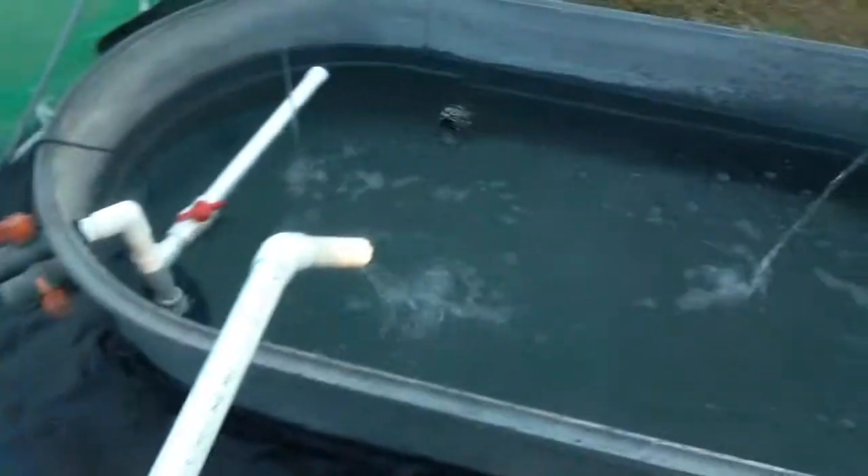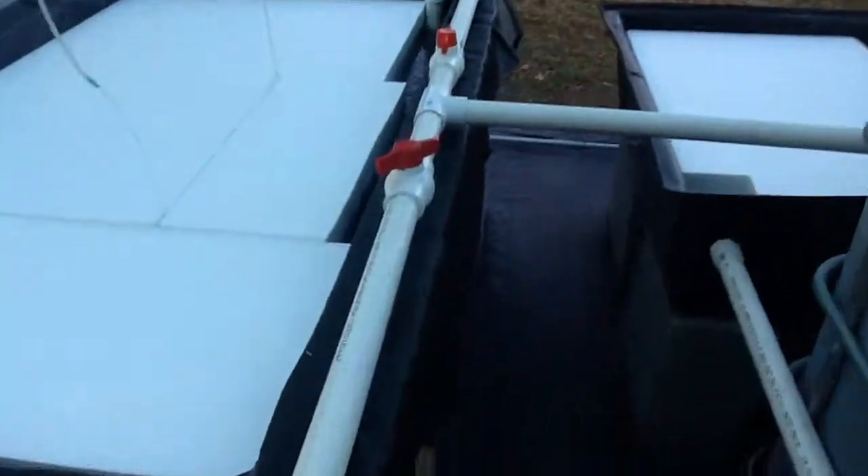It's all factored down to the kind of fish, growth rate, and feed efficiency ratios. This large floating raft system I made out of wood crates and wooden pallets — throw-outs. I made the whole floating raft with a continuous base, lifted up the sides with plywood that was thrown out, and I've lined the inner part with plywood so that the butyl rubber liner doesn't catch on anything. The outlets from both deep water culture systems return to the pond.